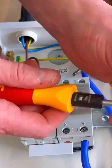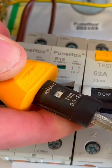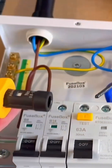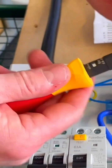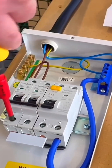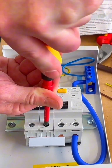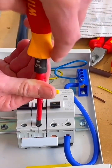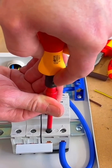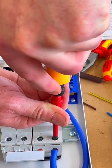The torque setting should be 2.4 Nm and the blank window shows 2.5. Bring back in the mechanism, make sure it's locked off, and then tighten the ones we know were loose — push nice and firmly. One click — tightening up. One click — tightening up. And the last one — one click. There we go.